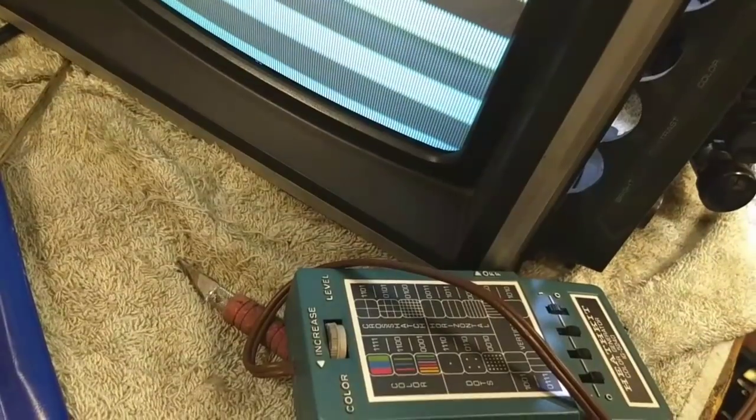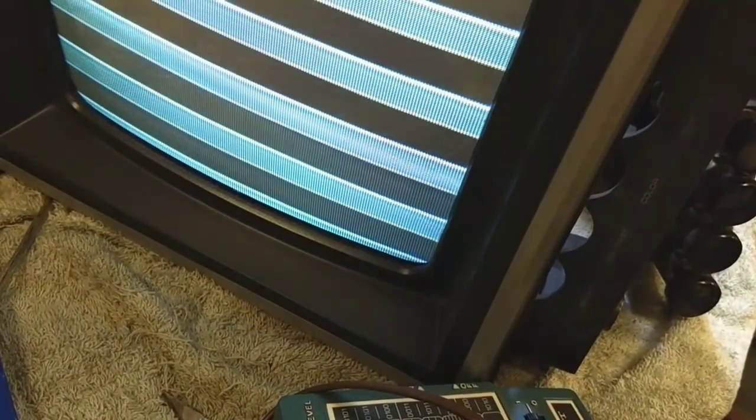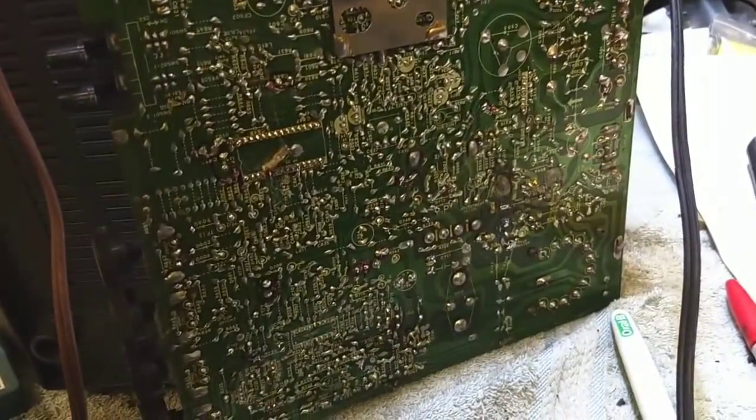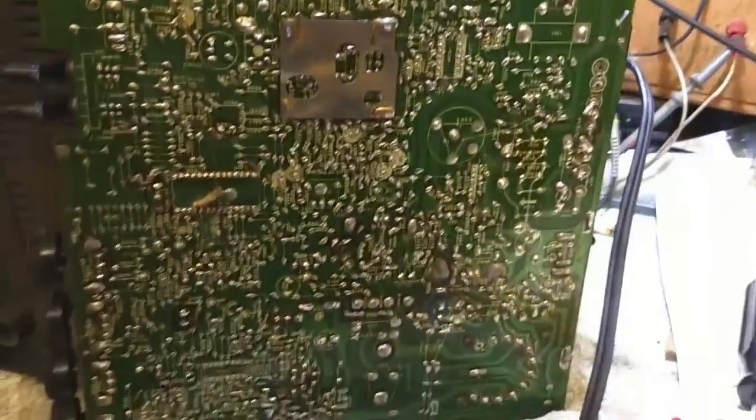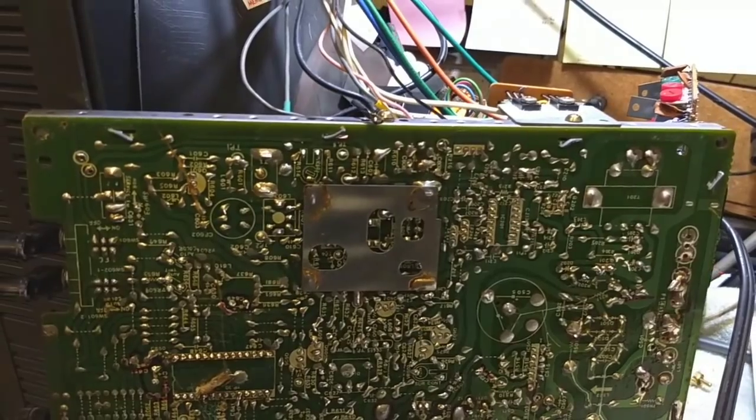Just a few moments later, I'm now back to a black and white picture, and the hum bar is still there. I grab the fine tuning and go too far off one way and the bar moves and becomes highlighted. So I don't know what's going on there. We've got the dark area up at the screen again — it's like we've got bad power supply voltages, but we don't. We had that missing core in the IF, but replacing it only helps the video response mildly, so I don't think that's it.